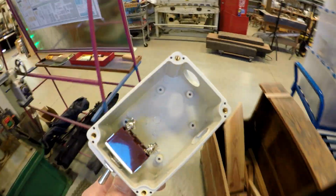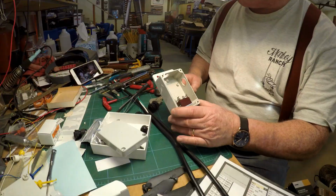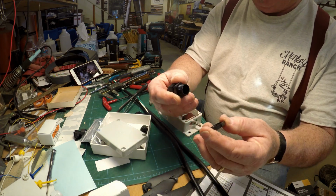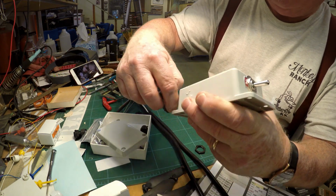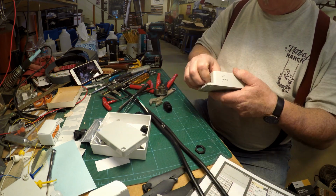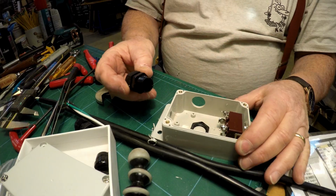Now, there are many advantages to having a machine tool with a VFD. For one, you can get very precise control of the motor's speed and over a wide range. It's relatively gentle to the motor, and it can adjust for varying loads, so once you set a speed, it holds it no matter how hard you work it. These characteristics are desirable in most every machine tool, but they're very useful in a wood-turning lathe.